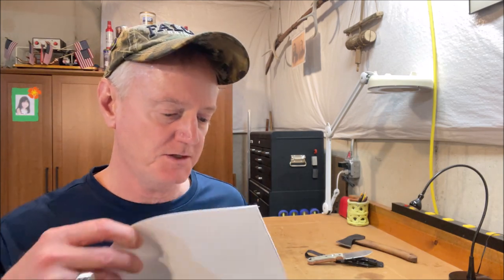It's about 10 pages long with lots of references at the back. The authors tested a variety of primitive natural material glues and did a series of different tests. The strongest glue they came up with was made from pine resin and charcoal — 90% pine resin and 10% charcoal by weight. So that's what I'm going to try. They didn't discuss using any organic material.